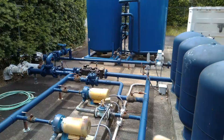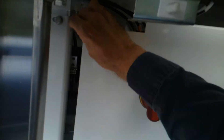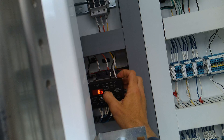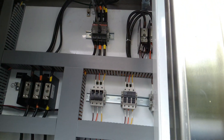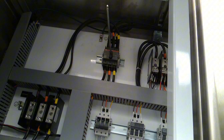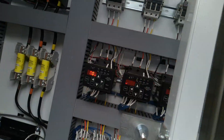Here are the booster pumps — one of them's running, which is surprising since they said it was tripped. Here's our control panel. Very strange, four to four and a half amps on our motor saver. Fuses are open on that one, and there it goes — it just shut off. I'm not seeing any tripped breakers.